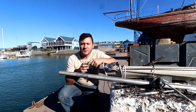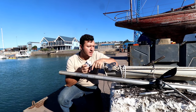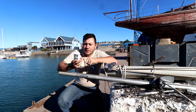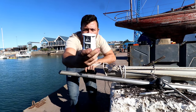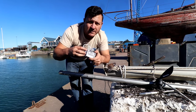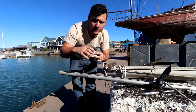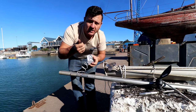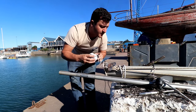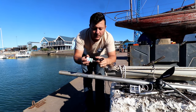So guys, we've got to that stage where the mast is outside and we're going to start prepping the mast — and I don't mean prepping in tons of fillers. We've cleaned it, washed it, and done all of that. In terms of gear, that means installing our tri-color light with anchor light. Very nice setup. I believe Lalisse does this — they're super nice, very neat looking. We can do it because we have a vessel just under 12 meters, and this is for vessels just under 12 meters. So we're lucky — we don't have to do the two-bulb light and all that, although we still need a steaming light. We don't actually need a stern light because this one has one in the tri-color, but we will install one at the back anyway.